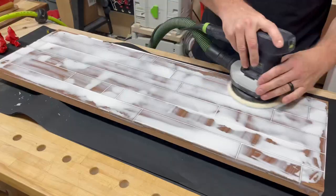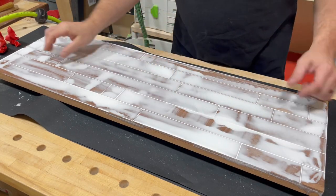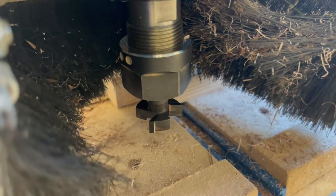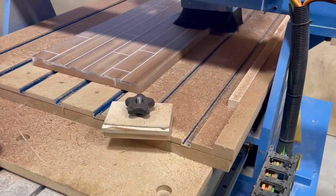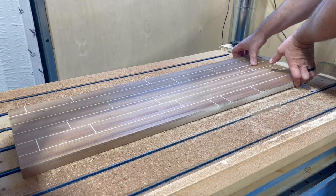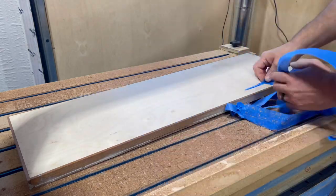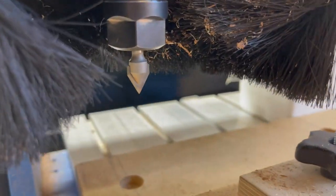I've got a CNC, so I'm going to try a leveling bit - it'll take about 10-20 minutes. And disaster. I had a bit that was as dull as a toothbrush and it burned the surface so bad. So I switched to a smaller surfacing bit - about an inch in diameter. It took a little bit longer but cleaned it up much better. Then we went back and sanded to a final 220 grit. I used the blue tape and CA glue method to hold it on the CNC, and that worked really well.